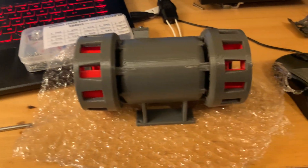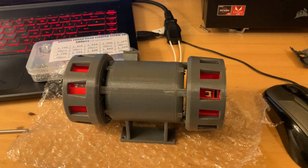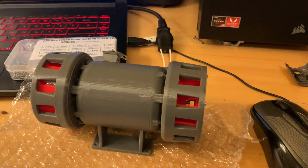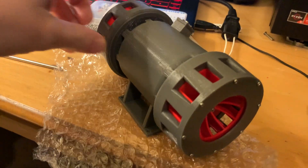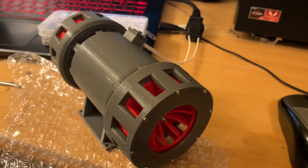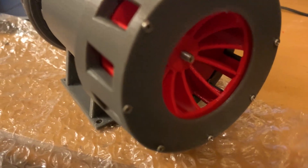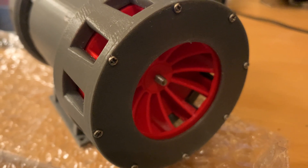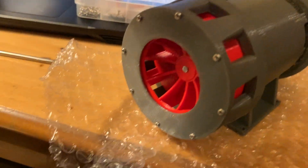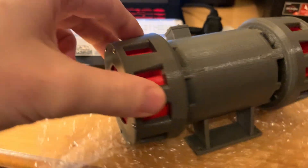That new shaft had to be tapped in and glued in place so we could get the correct dimensions, because it would have been way too short with the original. These are just little sleeve bearings in these motors, so you need fairly good tolerances — too tight and it'll barely spin, too loose and it'll wobble and the motor won't run properly. I've cut a thread into the end of the shaft and I'm trying to have the rotors held on with small nuts rather than just pressed on, so they can be unscrewed and removed easily.